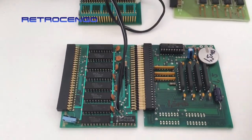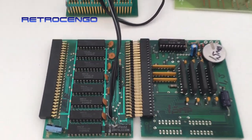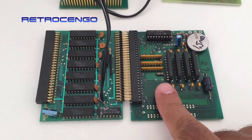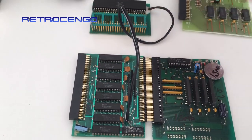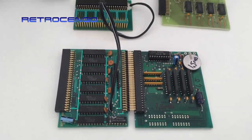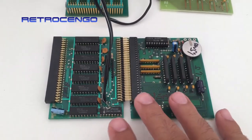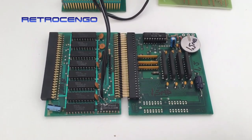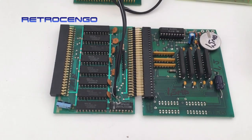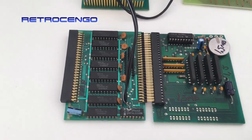Isn't that great! I didn't know this existed back in 1988. So with this connected and this one in the Gary socket, your Amiga 500 could have 2.5 megabytes of fast RAM memory expansion back in 1988. Isn't that great guys.